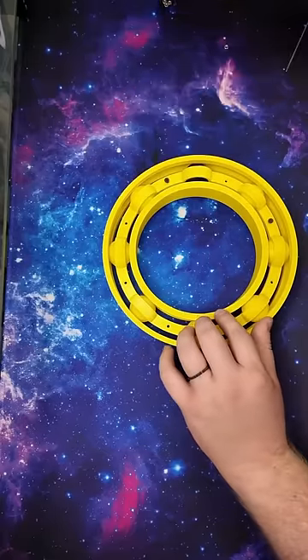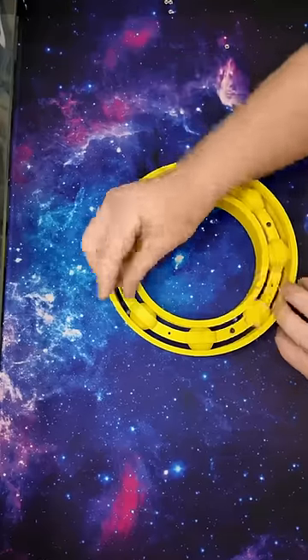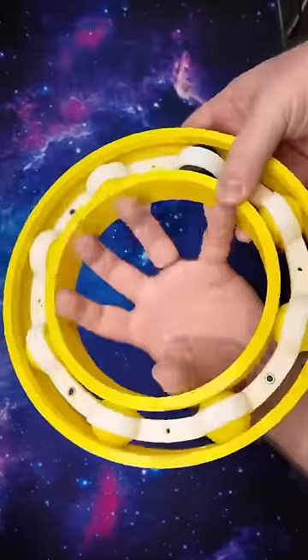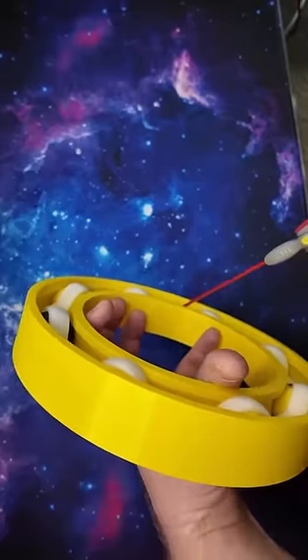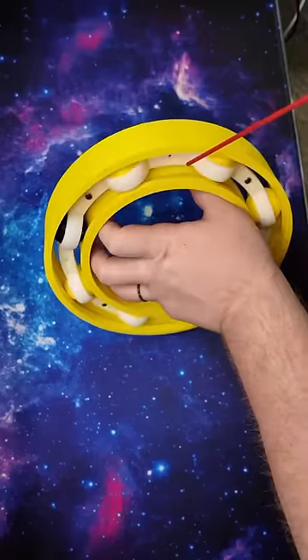The ball carrier has a perfectly spherical profile that keeps the balls perfectly in place, separated, and in contact between the ball carrier and the inner and outer races. The bearing I made is low precision, it's 3D printed, it's not lubricated, but it still works surprisingly well and is really fun to play with. Adding a little bit of WD-40 makes it even better, smoother, and more satisfying. Just listen to how fun this thing is to play with.